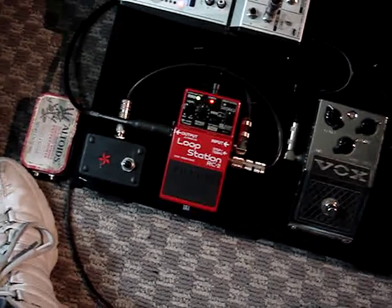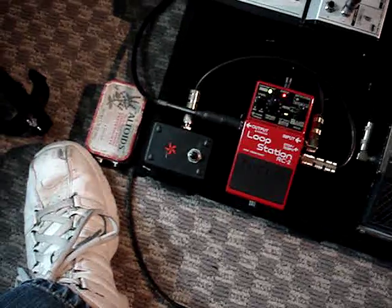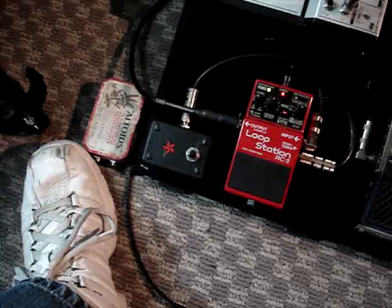The ones that you're getting at Radio Shack are all normally open. This means that when you press the push button down, you are completing the circuit. For a normally closed switch, the circuit is complete right now, and when I touch that button, that means that the circuit breaks.